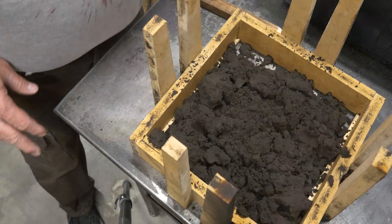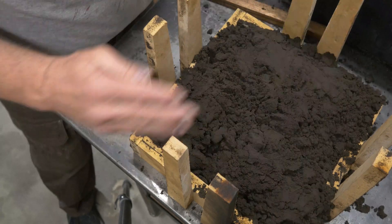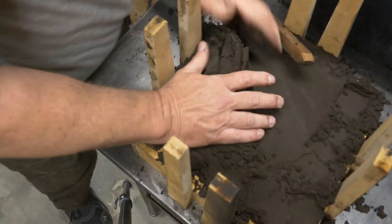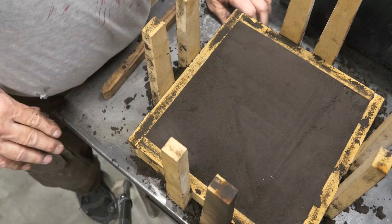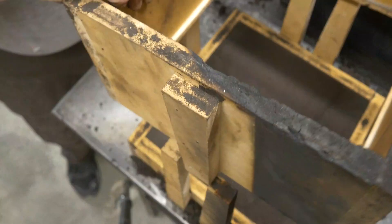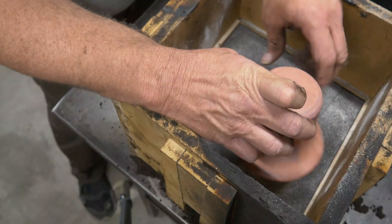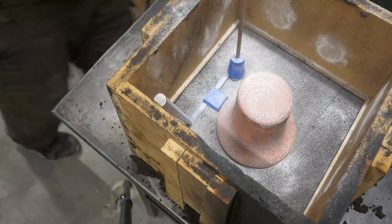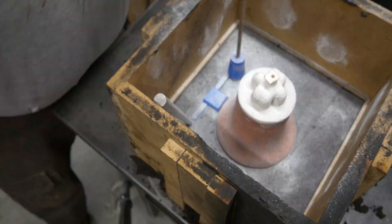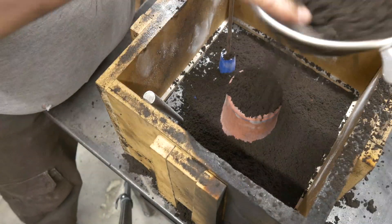I'm going to do a little voiceover here to talk about a couple of things. First thing I'm doing is ramming up what is called a false drag - a drag that is not going to be used as the drag in this mold. Basically I'm building up a platform that I can stick my runner into, and then I can ram up the cope with the runner in the right place and orient all the pieces I need. You'll see me tear this drag apart and then repack it when I have the bell actually up in the cope. There I've got my runner positioned into the drag - I've just pressed it down in there because I'm going to tear it out.